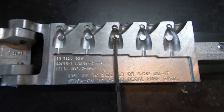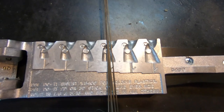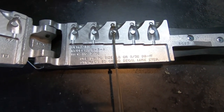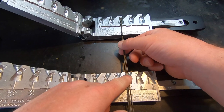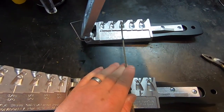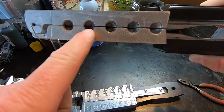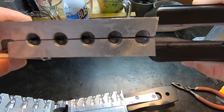We have our ultra rig set up with our wire form inside the mold. This wire form is super long so you need something outside to stabilize it - just having another mold is perfect. You'll need to pay attention to how you close up your mold so that everything lines up correctly inside and you don't get a bunch of flashing. If you see a gap, the wire form is not positioned correctly and you need to set it back down and get everything lined up appropriately.